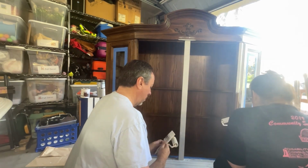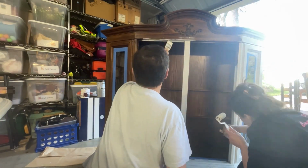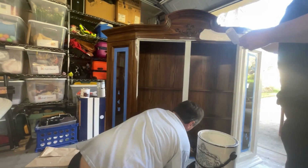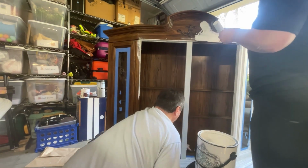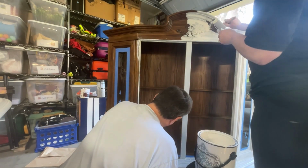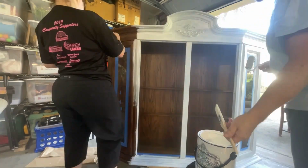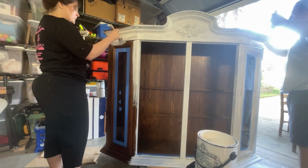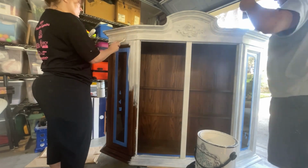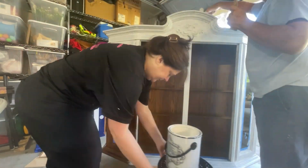To do that, we bought this paint, and this is not sponsored, but this paint, Heirlooms Traditions paint. I'll link that in the comments because it's easier to find it in the comments. You order the gallon of paint, an all-in-one product, and you also order the surface prep, which is a deglosser, degreaser, surface prep. As you can tell, we didn't do any sanding, nothing. We just wipe it on like a liquid, you let it sit for 60 seconds, and then you wipe it off. And then you can start painting.